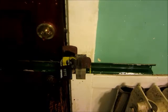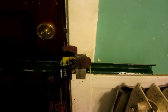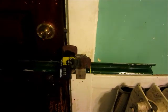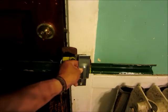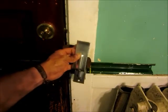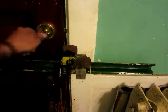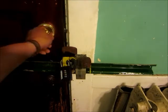So I got screens, indoor cages under the windows, and an ADT security system also. When I put a lock on these doors, they sell these little hooks that you can put on there. Use three and a half inch screws, put your 2x4 on there, and they can't kick your door in — and they really do work good for security. But my whole problem wasn't with that. My problem was someone opening the door and walking right back out.